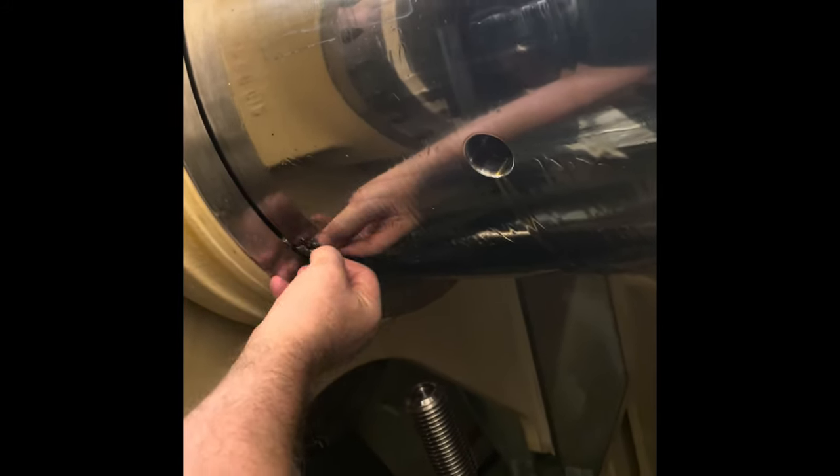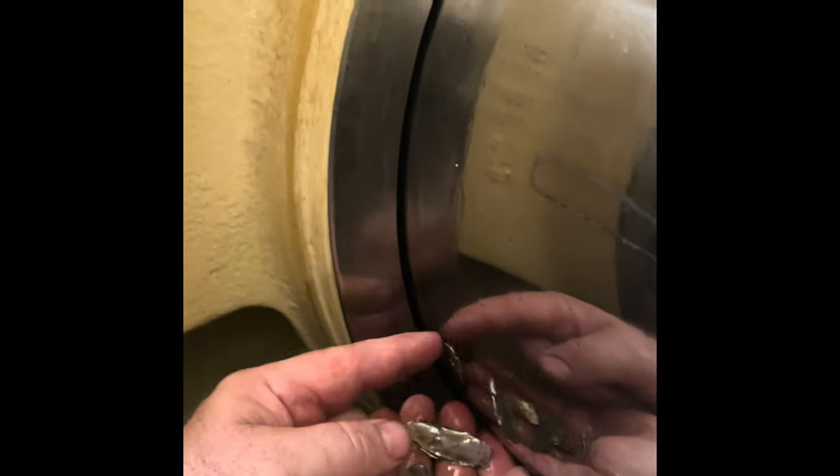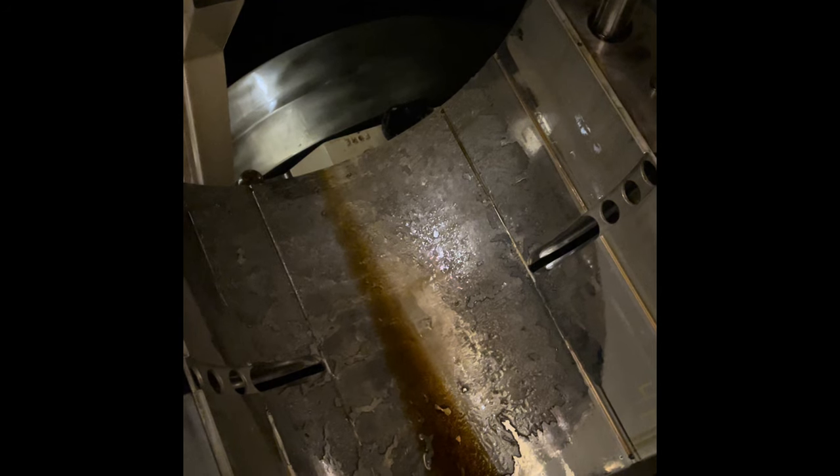I said earlier that all my crosshead bearings have failed and white metal came off from the steel backup. That is because of a bearing design fault. So here you can see I am removing the white metal chips on the pin, and these white metal chips scratch the pin. You can see on the bearing that this white metal damage was up to the end of the bearing.